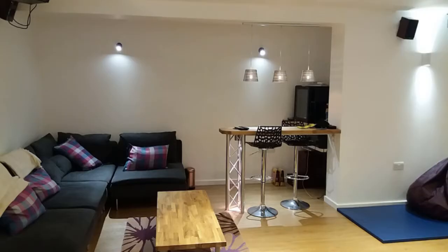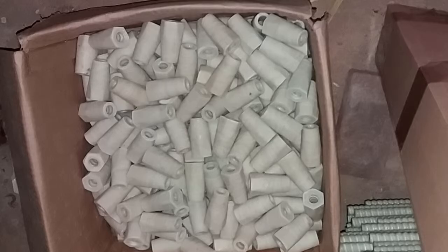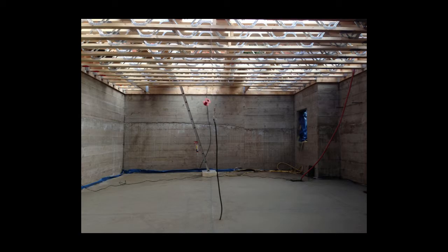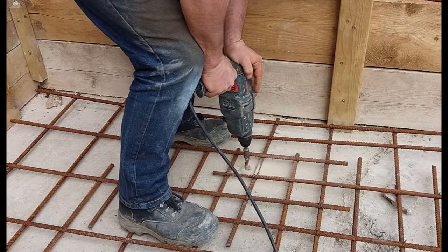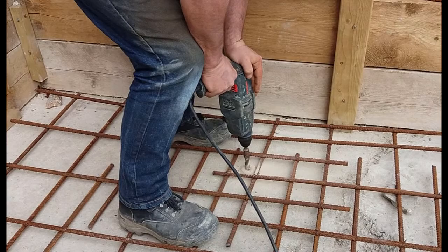We have been building domestic basements since 2004. Our new solution is to make use of our threaded fiberglass rods and fiberglass nuts. Fiberglass in concrete is waterproof and won't ever rust or rot. The rods can be drilled in and fixed with resin so that the tops are top of concrete, and the nuts give you a fine tune to get the screed rails dead right. You only need to find the space for a long drill bit between the rebar, therefore you can put these rods anywhere that a chair won't go.